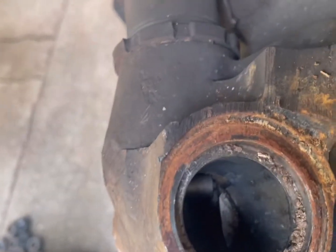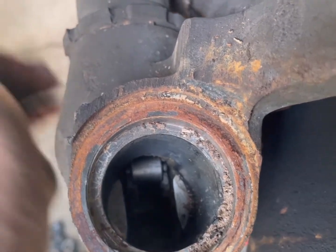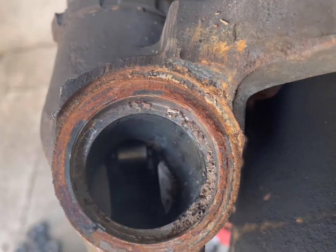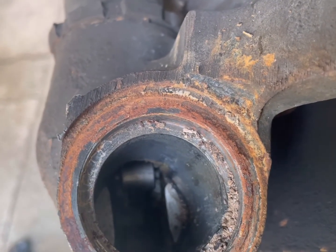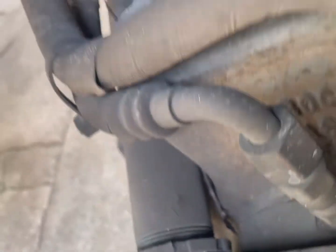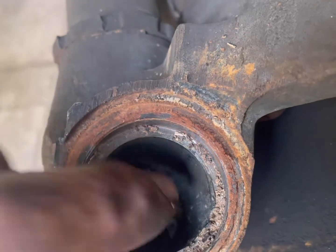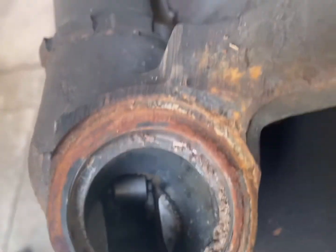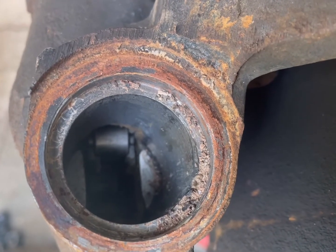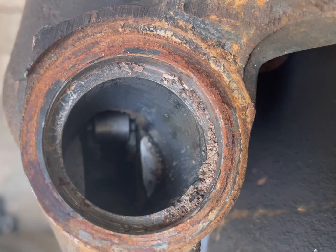Down here, if you can see that, that is your roller down there. As the brake is applied, that comes out. Now, I can do all my work on this one. I know that there's nothing in that tube here, a rod that comes down from the air piece. But right here, all this in here, I use white lithium grease. I work it all through there and relubricate it, clean it out first, blow it out.